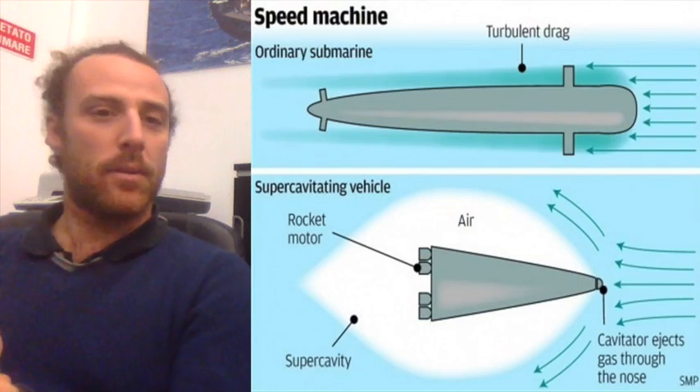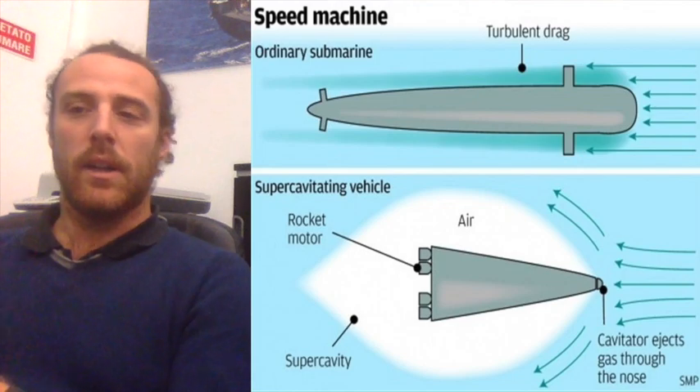So with normal profiles, there is at a certain point the problem of the foils increasing drag a lot when increasing the speed. The speed limit for a normal sailing vessel with subcavitating foils is around 50 knots. Subcavitating foils — we are talking about like a NACA profile — which is good for air and good for water under this speed, while above this speed you have bubbles coming up, creating like themselves a NACA profile going around the foil.